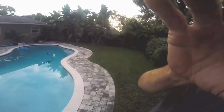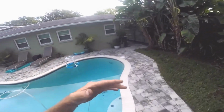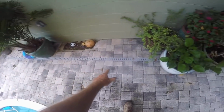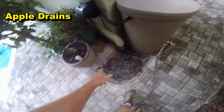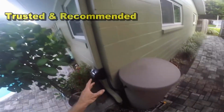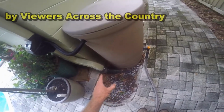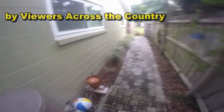And what it does is they've got a crawl space on this addition right here, and of course that water, you can see all the pavers, it just floods and goes right underneath. Yes, they have a channel drain, but what it's doing is it empties right here. They've got their entire gutters coming over and coming down right here, and they put in a drain, somebody did, but it doesn't discharge fast enough. In other words, it runs uphill as it comes out and going to the street.